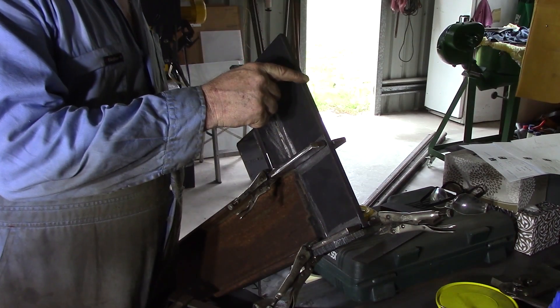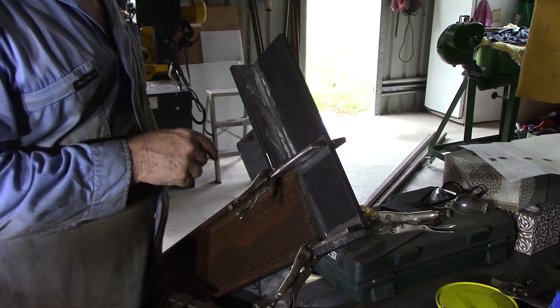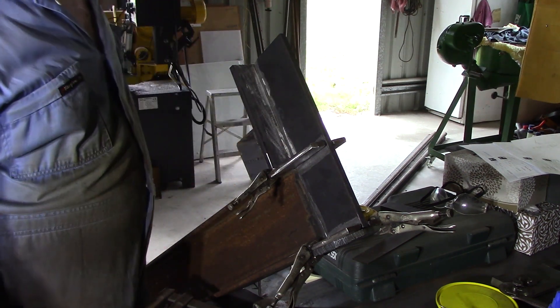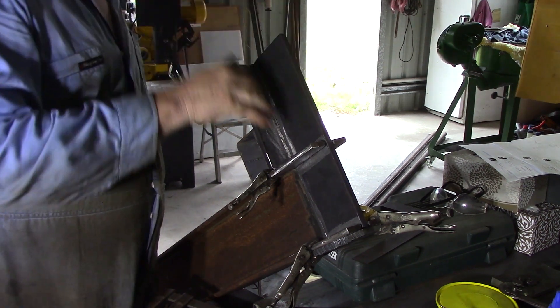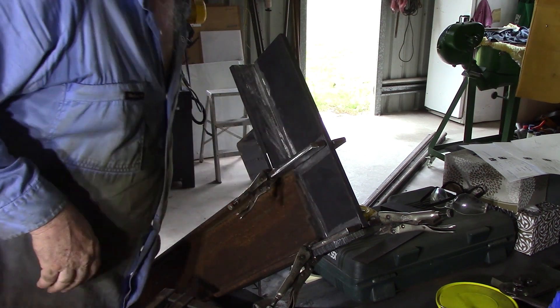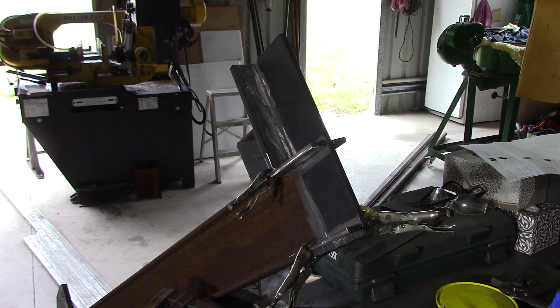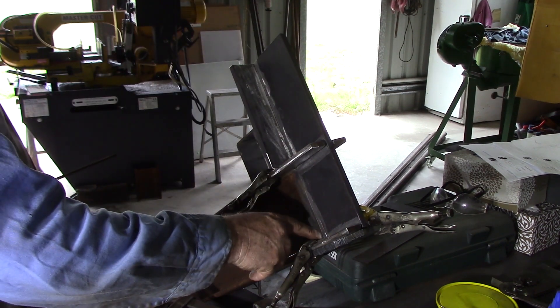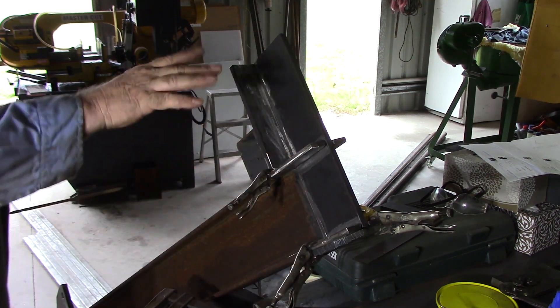This is part 009 and part 010. I've painstakingly set these up so that 009 is in the centre of part 010 — everything's lined up side to side, nice and even. The other two 009s go down the outside, but what I want to do first before I put them on is weld both sides of this centre one, because I'm not going to be able to get to it afterwards. Because I've plasma cut it out, I've got a little bit of gaps here and there, so I'm going to put a tack on this and try and hold it — maybe put another couple of tacks down there. I might use 6013 for these tacks because the 7024 is not going to work too well on a vertical. Once I've got them tacked, I'll pull it out and go ahead and put some decent welds on it. I want to get these side welds in before the outsides go on, then do all around inside, and then put the outside pieces on last of all.